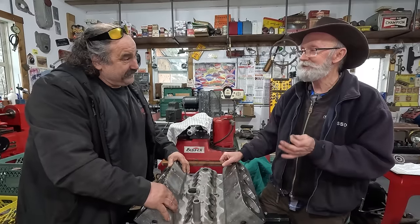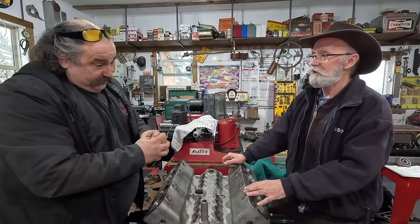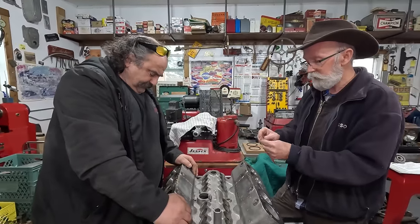Because with cast iron, it breaks and stretches if you weld it — it'll look beautiful for approximately about one minute until it cools down and it'll go bang. It breaks the weld open because the material doesn't move at the same speed as each other, so it'll literally break the weld apart. So I chose to go with this cold process of stitching with these little pins.